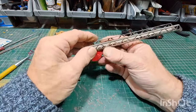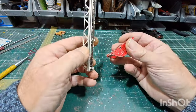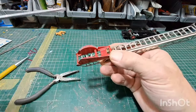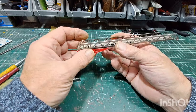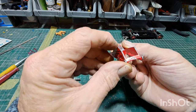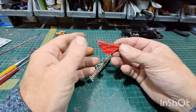The last remaining piece was this piece. Now this fits in with these here — one, two, three, four. They fit in there like that. What you do then is they bend over to grip that — bend over to grip that, bend over to grip that. So that's your base, that's your bottom ladder. That's your windy-up bit. That's why the cog wouldn't come out — because it's got a ridge on it there, just there, it was just stopping it. So you had to release the other one to give that a little bit more manoeuvrability to lift it up over that bit. So we found something new out, like you do every time you do one of these restorations.